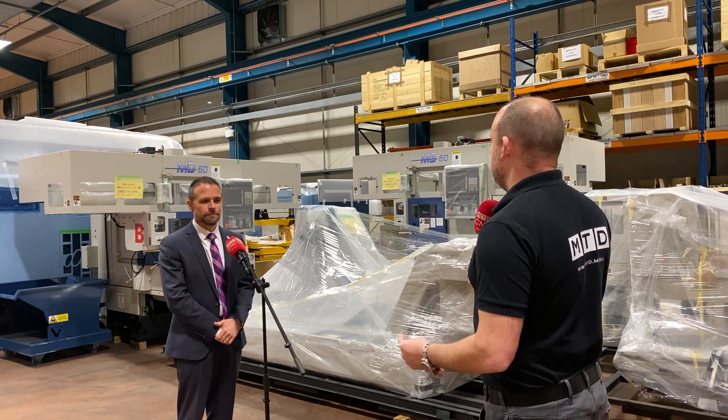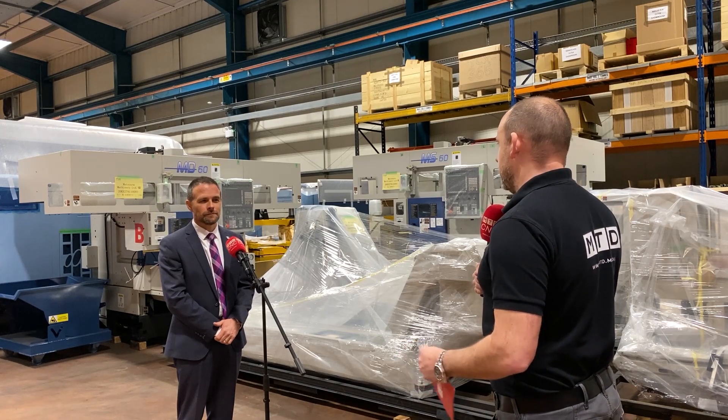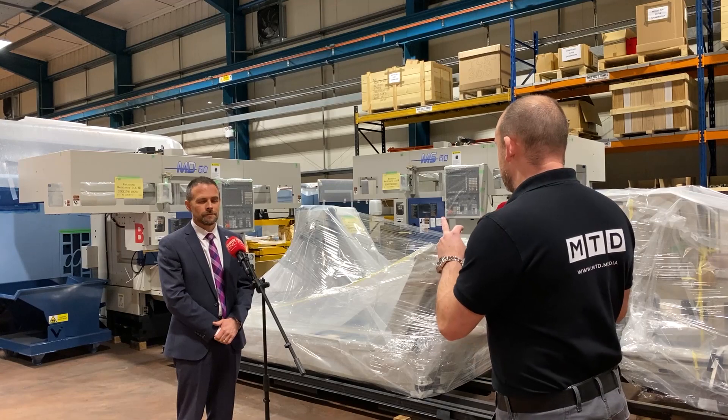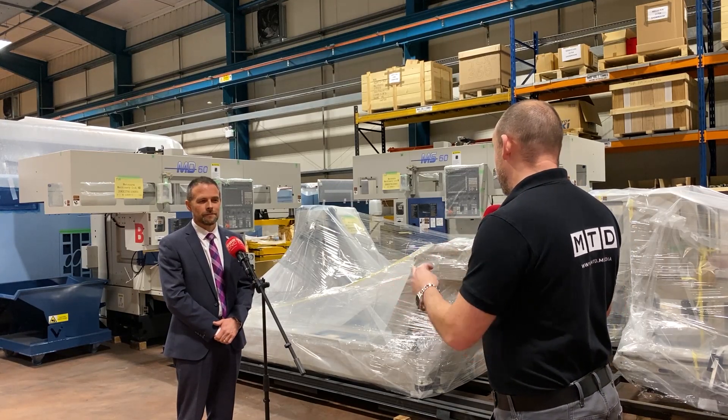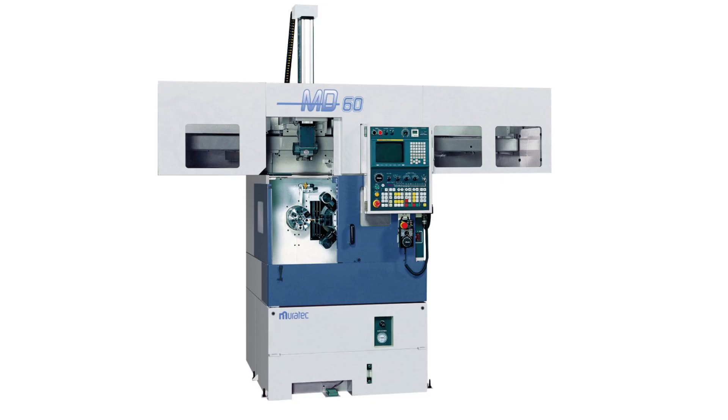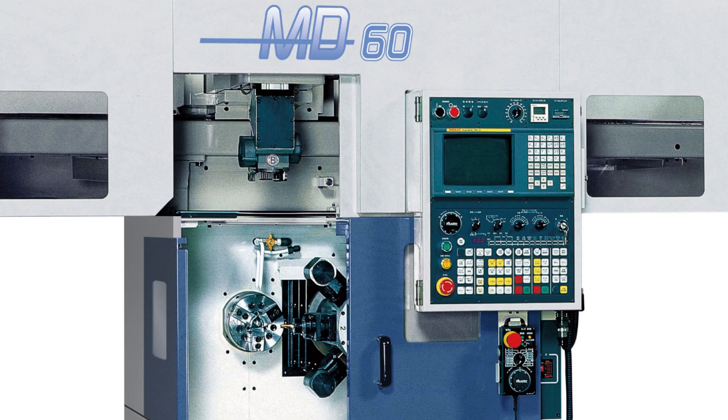So let's take an alternative then — you have a two axis lathe and you install a robot next to it. What's the advantage other than what I can see here of size, which is obvious to see, but what's the technical advantage to it? Well, the footprint is the main thing really, because obviously the stocker and everything sits in the same footprint. But if you were to add a robot for billet loading onto your existing CNC lathe, the cycle time for loading through the front door of a machine is around about 45 seconds, but this range of machines from Murata will load in five seconds.